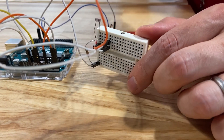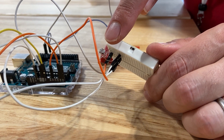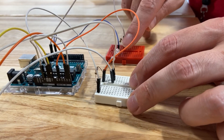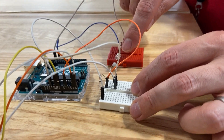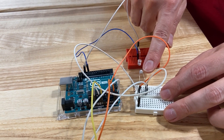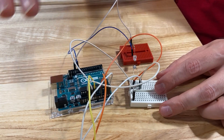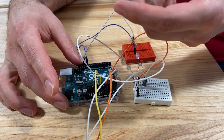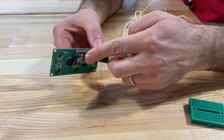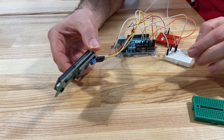And this is your receiver. You see here, like a zigzag pattern — this is actually a resistor, but it's a photoresistor. What it does, it senses the light. So when the LED blinks at different frequencies, you receive it from this sensor. This is a pull-up resistor. Then the microcontroller reads that and says, okay, this is the message that I'm getting, and then it shows it on this screen. You can see the four connections — two for the power and two for the signal, the serial port message.